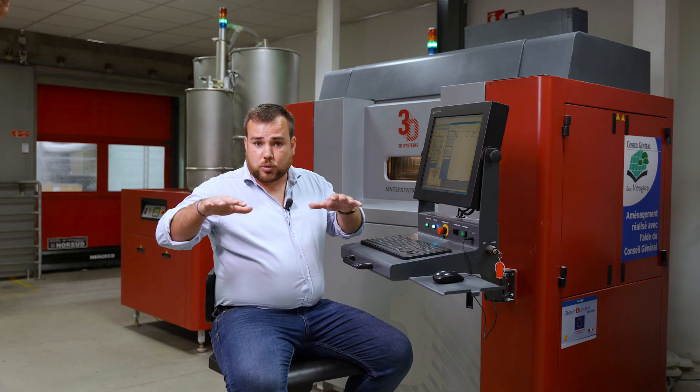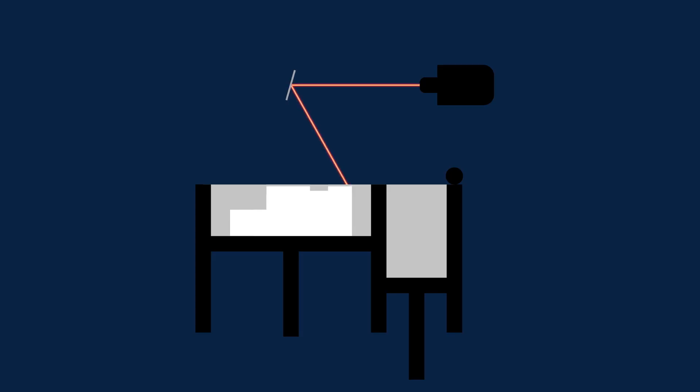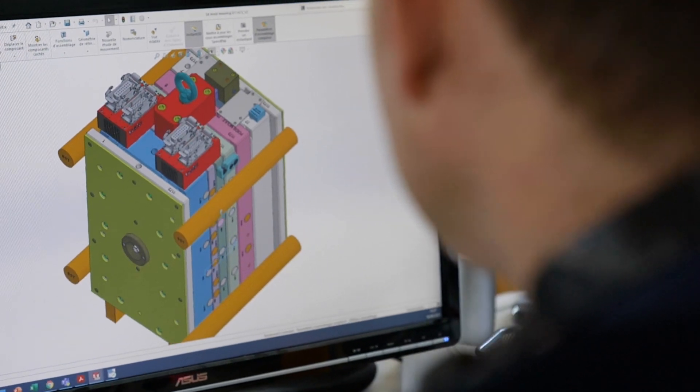Basically, we've got a plate onto which a roller spreads a layer of powder. This layer of powder is sintered using a laser which reflects in a mirror based on the 3D model input to the machine. Once a layer is made, the roller applies a second layer, which is then sintered. The process continues until you have the finished object inside your powder cake.